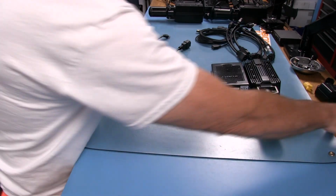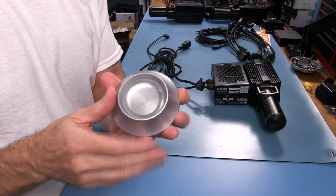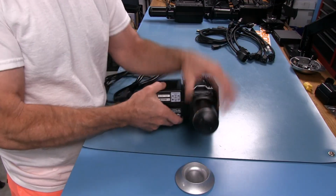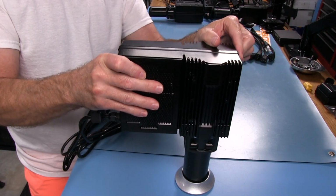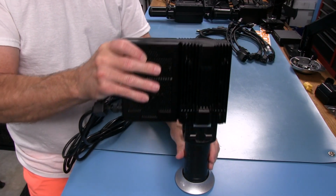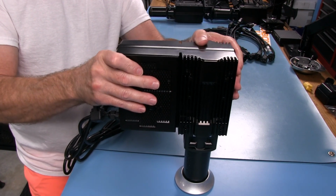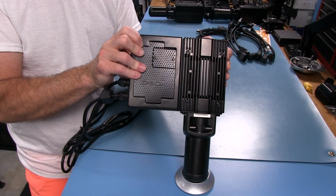Oh, let's talk about the foot real quick. Again, aluminum foot. It has a nice little finish to it here. And of course, this is going to fit on the foot of the actuator. It's going to let the actuator, let's do it this way, have a little bit of freedom of movement. Again, this is the non-captive. So captive would be something we bolted down and remove this foot and put another piece on that, right? So this just gives you a little bit of room here, a little wiggle room, if you will, so nothing will bind up when the system is being used.